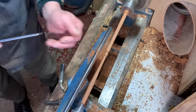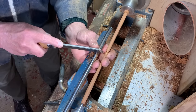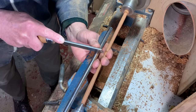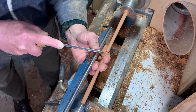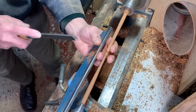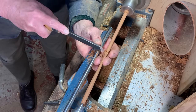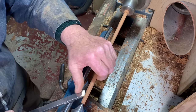It's getting quite springy. I want to put a groove in the middle of that — a little bead. The forefinger comes up underneath. You just need to make sure you're arcing the point of the tool into the wood. This finger is also acting to help control the flexing. You just go gently. Coming up here I can now grip the tool — I've got my fingers almost round the other side.